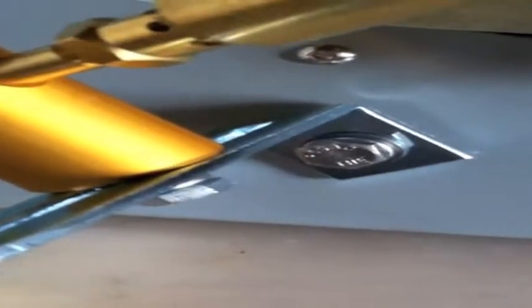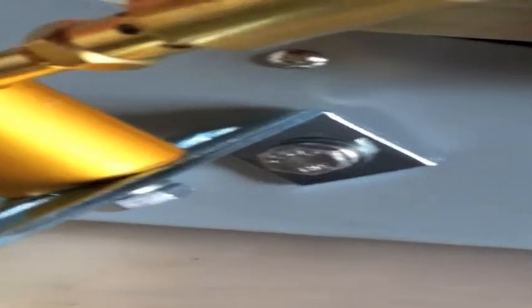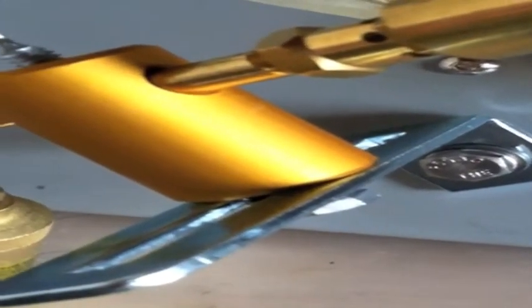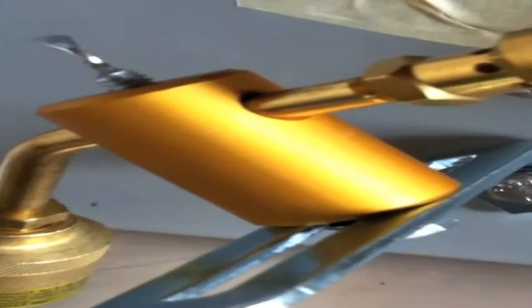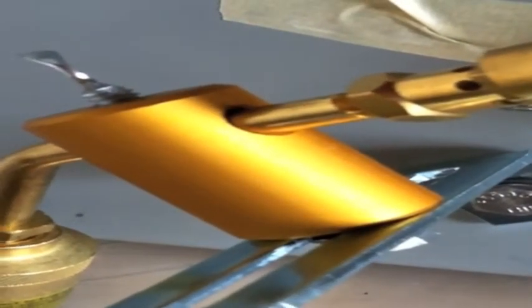The tools used for the installation are just a small wrench — I believe it's a six-inch wrench — and a screwdriver with an attachment so I can get in there without too much of an issue, plus the blade to cut my Teflon tape. It's a quarter-inch bolt that needs a seven-sixteenths wrench, and the nut is on the other side.